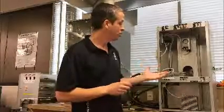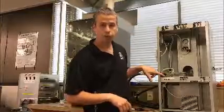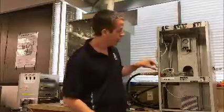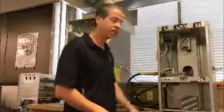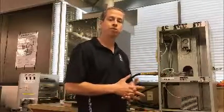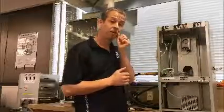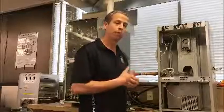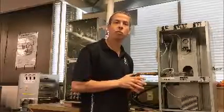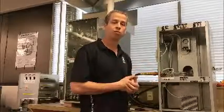And now once we are on, or our main pilot is lit, we would take our main gas valve here and switch it to the on position. And so we just turn it like that, and we are in the on position. Now all that we would need for our basic gas-fired furnace is to go to the thermostat. Normally it's going to be positioned somewhere in your living room, and we can turn it up to the desired temperature that we want for the house.